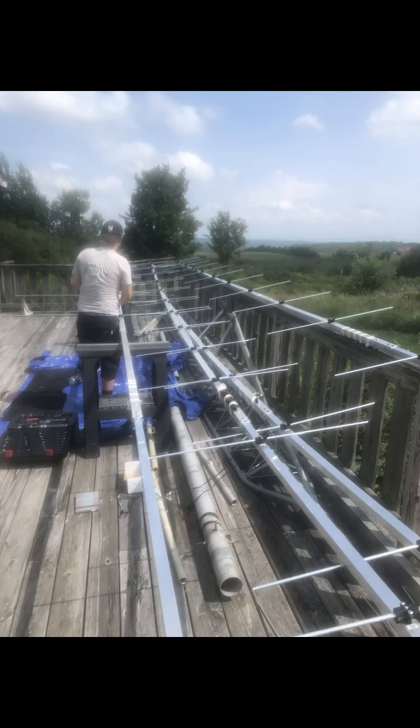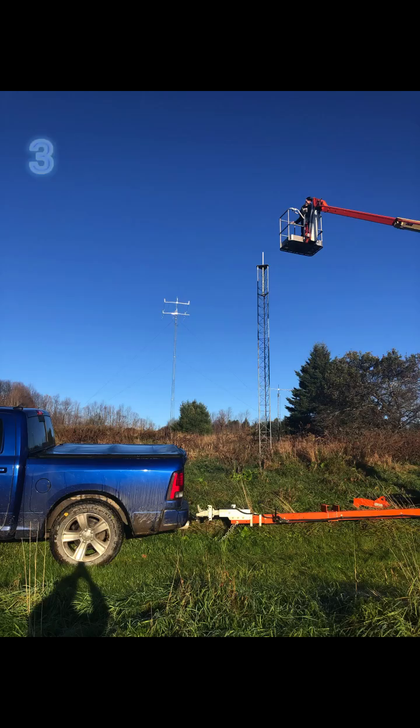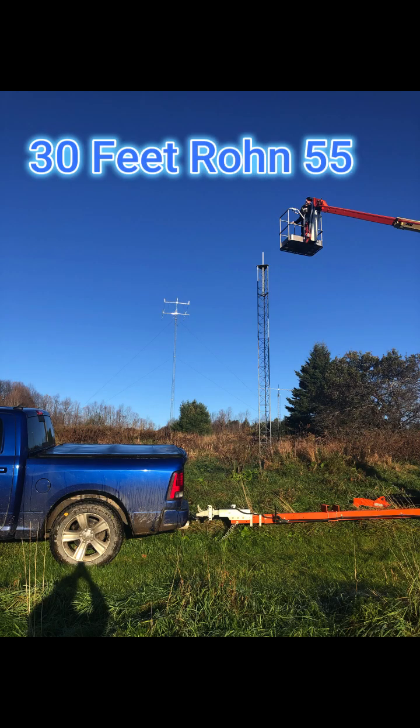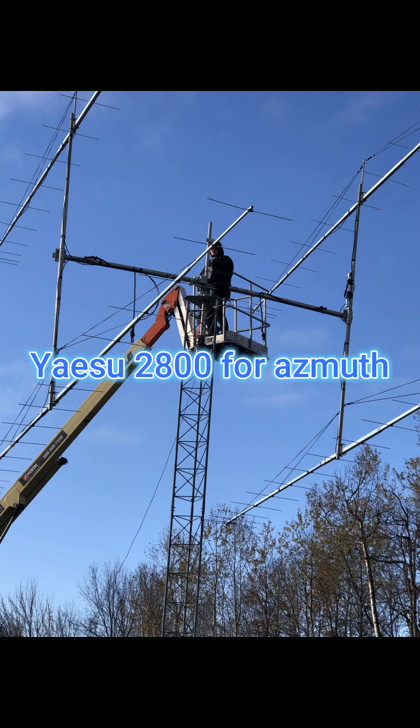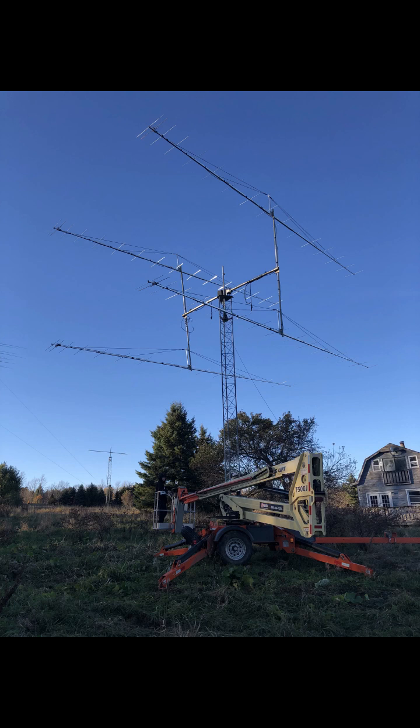We got four on the tower. Here's my son Bobby building the four antennas — we built them on the deck. It's a location here in the Catskill Mountains. That's a three-inch boom — you'll notice the motor's attached already to the boom. We came in with the man lift; this has to be built with a man lift, just too difficult otherwise. You'll notice we got the boom attached to the mast and the four yagis up — the man lift came in very handy for this build.